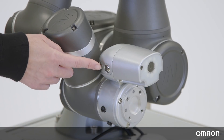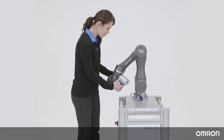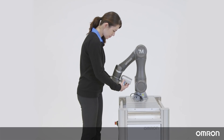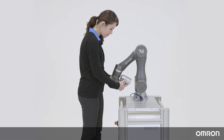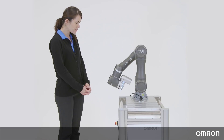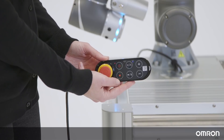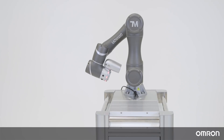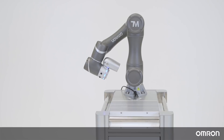Find the button labeled Free at the end of the Cobot's arm. Use this Free button to move the Cobot into the first-time startup position — please refer to the manual for the proper startup position. When you press and hold the Free button, wait until the brakes release before attempting to move the Cobot; you will hear a clicking sound as each brake releases. Press and hold the Stop button for 2 seconds. The Cobot will then enter the calibration process, during which each joint will move slightly to calibrate. After calibration is completed, the light ring will change to blue.